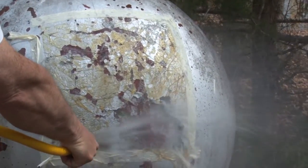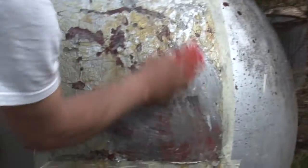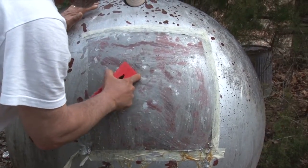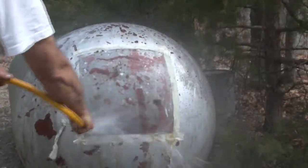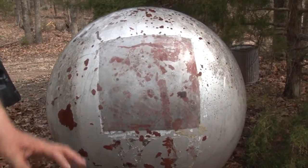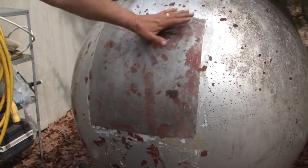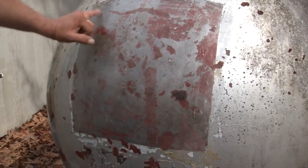Now with a pressure washer, you'd have it totally peeled off. I'm going to take a brush to this. The pressure would peel all these little spots here that maybe we didn't have quite as much chemical on — they are de-bonded. Let's rinse it. Like I say, we got into a rain and hail storm after I'd applied this, and a lot of our top gel was brought down and ran below our boundary and de-bonded that area too. But because of the rainstorm and colder temperature, the total reaction time was not as complete — otherwise it would be down to bare steel, just like these areas right here that had reacted before it ran off.